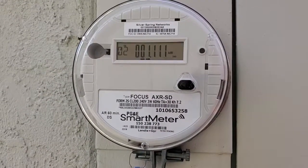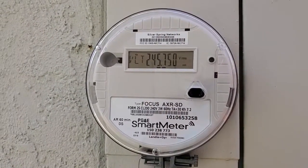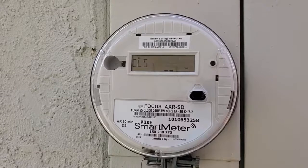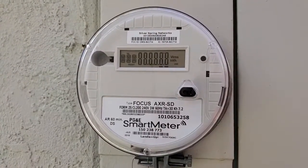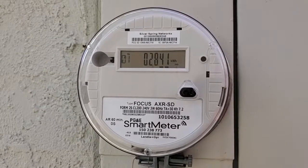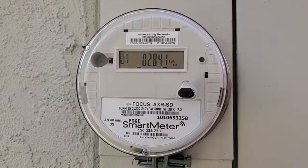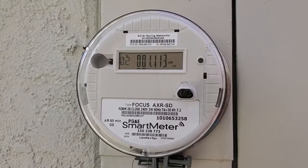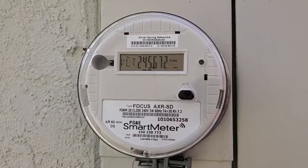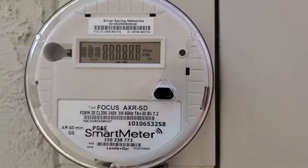The final piece here, I believe, is telling me what the current line voltage is — 245 volts coming in on this 240-volt line. So it's a two-phase connection here, so that 240 gets split into two 120-volt phases inside the house for the house current. You can see it's 245, basically what we want to be seeing.